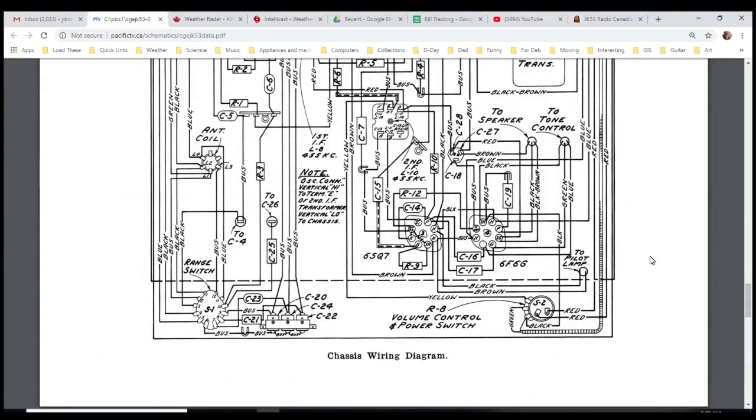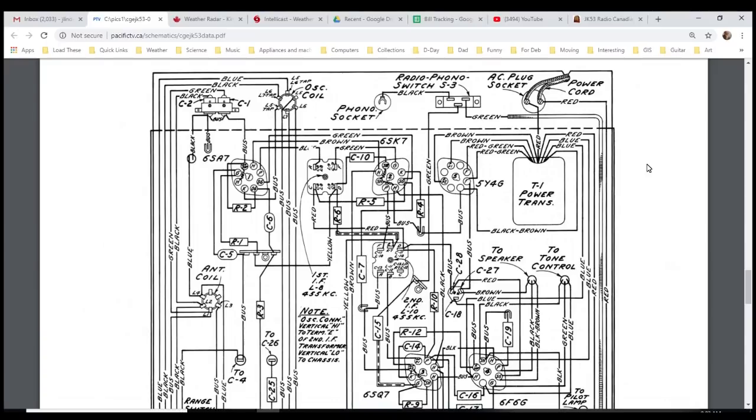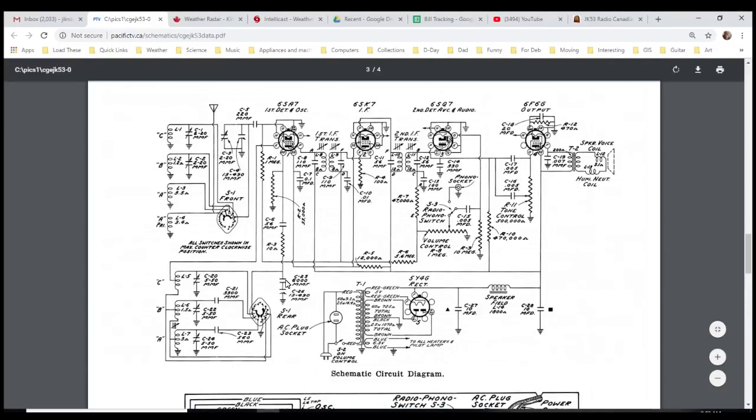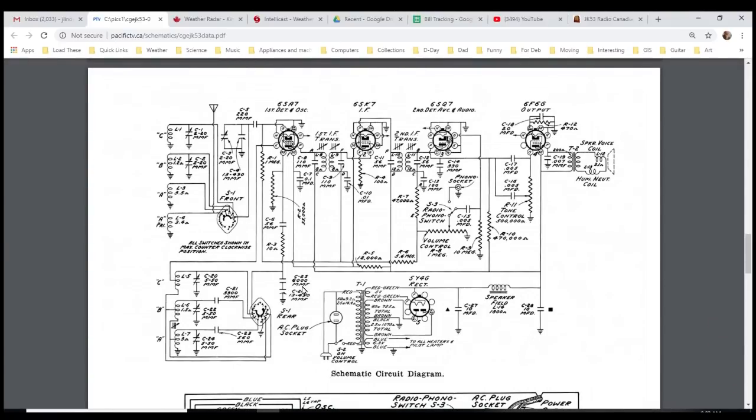This diagram is going to be really helpful to identify the specific parts I'm about to change. I'm looking for fixed capacitors — not trimmers. I can see 56 picofarad, and counting them: one, two, three, four fixed ones. I'm finding what looked like four potentially molded capacitors in the front end. This bigger one is microfarads while this smaller one is micro-microfarads — it's a much smaller capacitor. Maybe I just didn't spot the fourth one in the back of the radio. Let's go have a look.